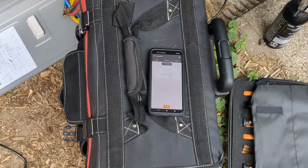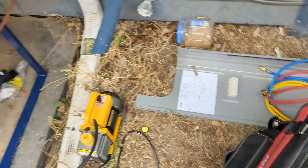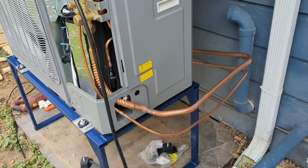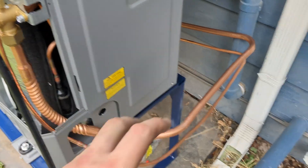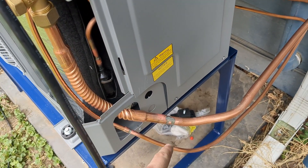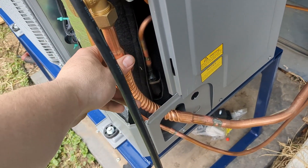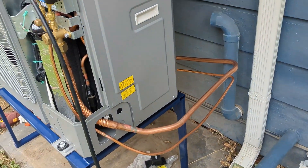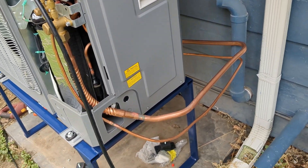I've got my other phone over here. Currently it's too high for it to read, but that'll come down as the pump runs more — depending on whether there are any issues or leaks. If anybody buys these units and plans on using normal lines, make sure you get these adapters, because bending the line to get it in here would be a real pain. We're just chugging along now, waiting for the evacuation to finish. I'm going to start wiring it and get these lines taped up.